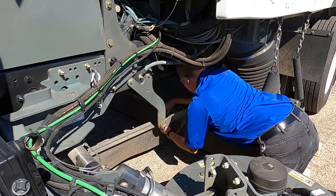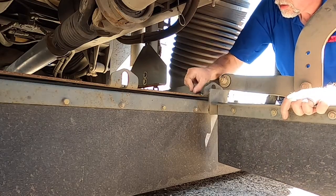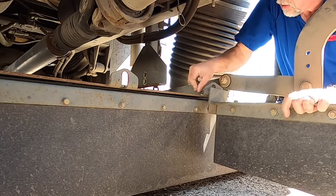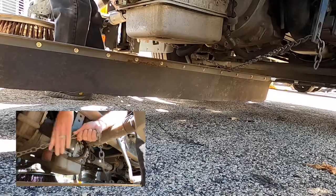We have found that setting the center board to the left side gives the greatest area for picking up leaves. Use the leftmost position on the pickup head and adjust the chains in front toward the left side.